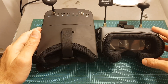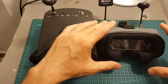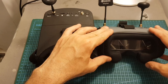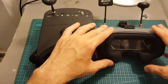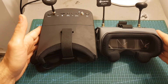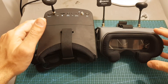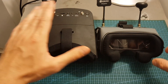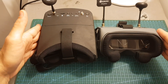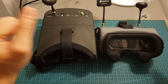This was supposed to be part 2 of reviewing the goggles, but unfortunately I'm having issues with mine — all I see is a black screen. It happened suddenly, and hopefully Eachine or Banggood will help me out; if I find a solution I'll post it in the description. Luckily I was able to take both goggles outdoors and compare their DVR side by side and perform a latency test. As I discovered, the average latency difference between the EV900 and the EV800D was about 100 milliseconds, which is a huge difference.